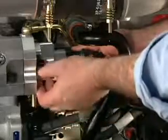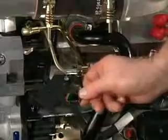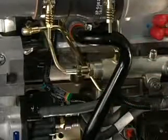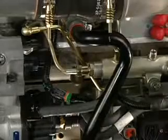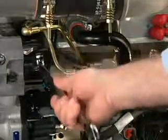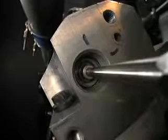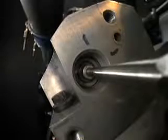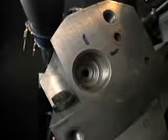Remove the fuel pump actuator housing following the procedure given elsewhere in this training. Remove the high-pressure fitting from the threaded hole in the back of the high-pressure pump head. Note, if it is necessary, use a tapered punch to remove the seal washer. Insert the punch into the center of the seal washer and work the seal out of the bore in the pump head.